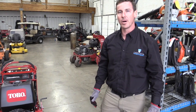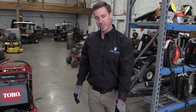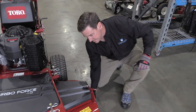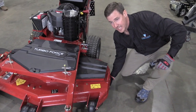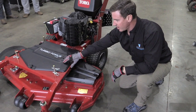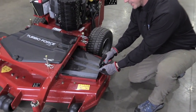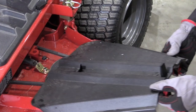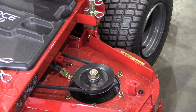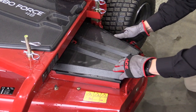At the end of the day, before stowing the mower overnight, make sure the mower deck is clean underneath. Put your leather palm Ace gloves on and reach under the deck to ensure nothing is binding or blocking the blades or building up underneath. Next, pull the plastic off the top to expose the belts so you can blow out debris, leaves, and any other items. Flip the tab up, lift the edge, and slide it out to access the belts. Blow that out with your backpack blower, then reinstall the plastic cover: slide it in, line the hole up, and push the tab down.